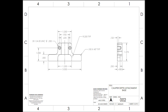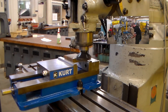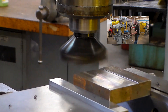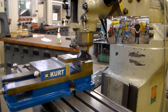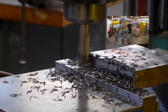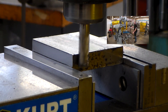In this video we're going to be making a caliper base depth measuring attachment. To start off I'm just face milling off the top of the part. The material stock is much bigger than I would need to make one base because I'm making two bases. Once I get that face cleaned up I switch to a half inch end mill and I'm profile cutting along the surface closest to the regular operator position, and I zeroed the readout — that's Y0 in absolute.